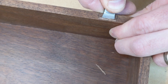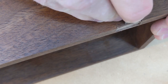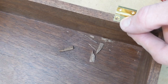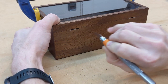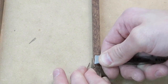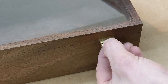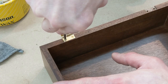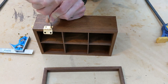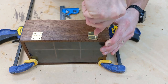The only downside is that they are a little pricey, so I tried a different hinge on the rest of the boxes. The mortise locations are marked with a marking knife, then cut with a chisel, and the location is transferred to the lid when the second half of the mortise is cut. The other hinges are an inexpensive surface mounted stop hinge. Installation is very quick, and function-wise they get the job done. Fit and finish is not nearly the same and being surface mounted they have a different look than a mortised hinge, but they do provide an affordable option.